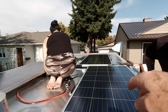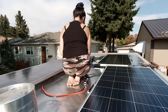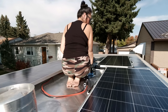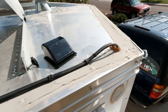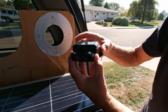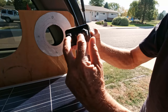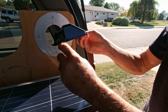Now we're getting ready to hook up these two new panels — the third panel over here is going to be totally disconnected from the system, so we'll just be testing the two new panels. On this trailer the existing wire just goes through right here. On yours, you'll probably be using a gland like this one. A gland is how the wires go from your solar panel down through the roof of your trailer and into the interior.